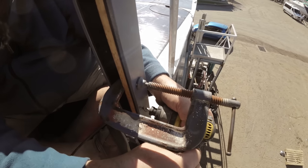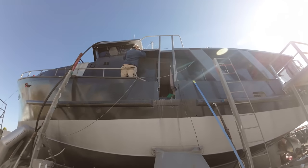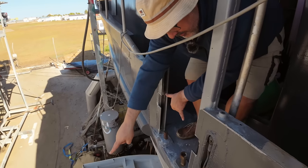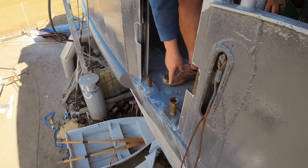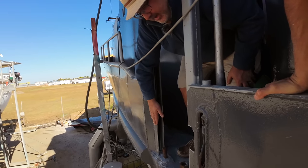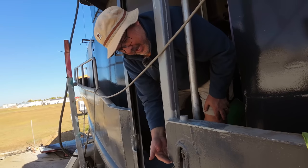The new battery really is a revelation. At the far end, the arm attaches to those eye holes down there — the big chunky ones. The top end comes in through these little gaps in the outer rails and sits down here. It's got a big plate that gets bolted on, and then Dame is going to make some sort of metal cover that patches these over, because the only time you ever need these gaps is when you're actually shipping or unshipping the struts. So these are going to be patched over — that's why we're finishing the plastic a little bit short of this, so there's room to put a little flange on the backside to hold them in.